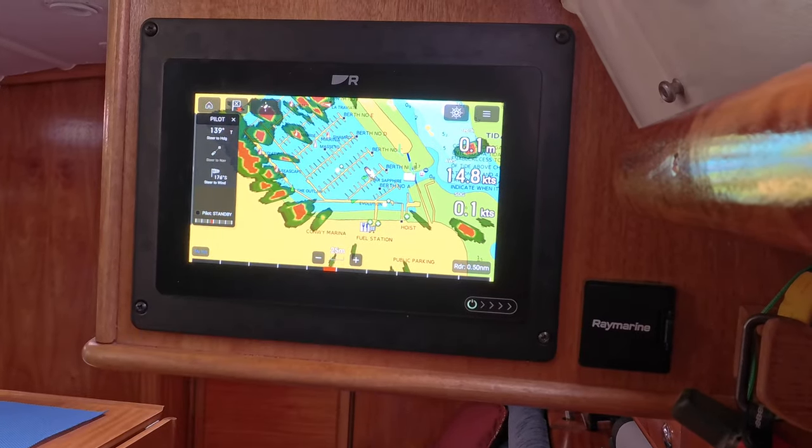The other mode I use quite a lot is Anchor mode. You start the anchoring wizard, let out however much chain you need — say 20 metres — then mark the anchor position, click Chain Out, hit Activate, and it says Track Started. It puts a circle around the boat and if the boat comes outside that circle an alarm goes off, giving you peace of mind so you can sleep at night knowing you'll be alerted if the boat drags. The green circle shows wind direction and the number shows wind speed. When you want to raise anchor in the morning you just cancel, delete, confirm, and go back to Navigate mode.